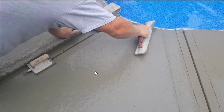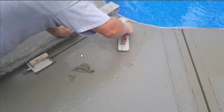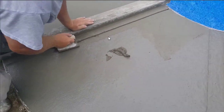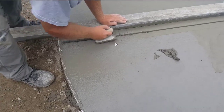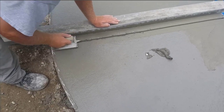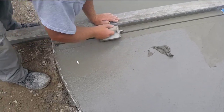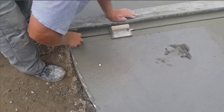You don't want to wait until it's too hard or you'll never get these joints in. So we tap the surface of the concrete with that groover right there, and that pushes down the rocks and it brings up the cream, and it leaves you that nice smooth looking joint right there. If there are any imperfections — any big rock holes — as you're doing it, you can use a little bit of paste from the surface and fill that in, then just run the groover over it and it will smooth it right out.